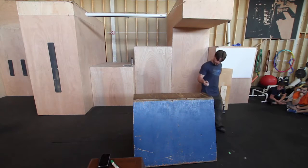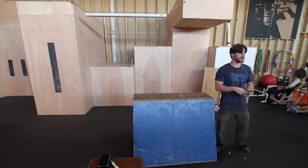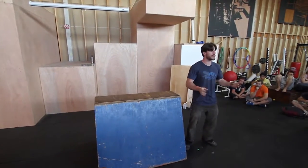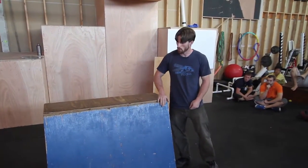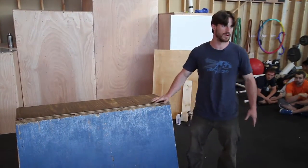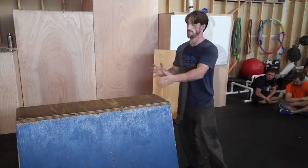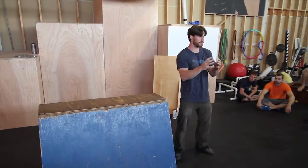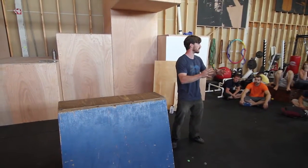The more fasteners you have, the better each one is going to do in resisting pulling out, right? If you only have a few in there, then all the force is going to be ending up in those, and those are going to start pulling out. The more important role of fasteners in something like a box that you are building is to actually tie the entire shape together. Anytime that you're building a box, what we recommend is that you build a frame for it first, and then you attach whatever sheeting that you're using for it, right?